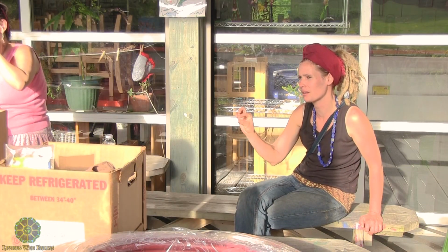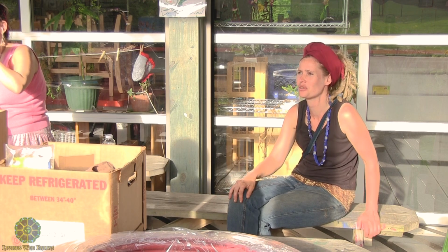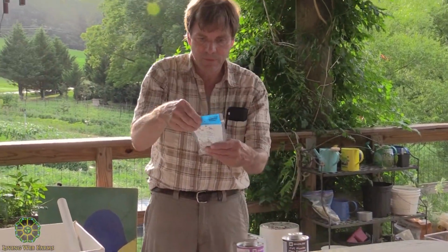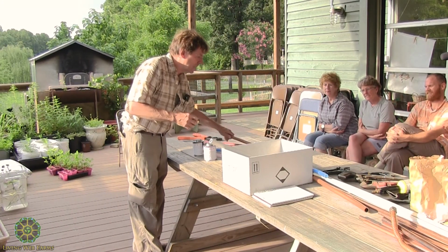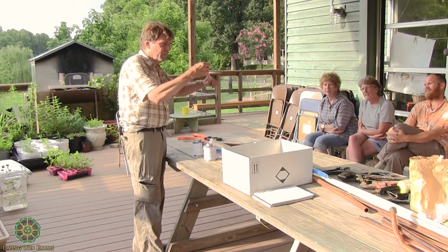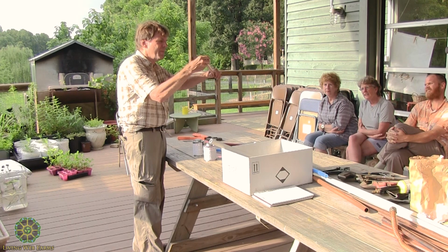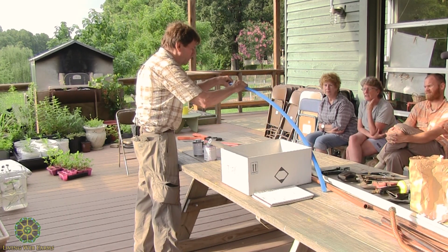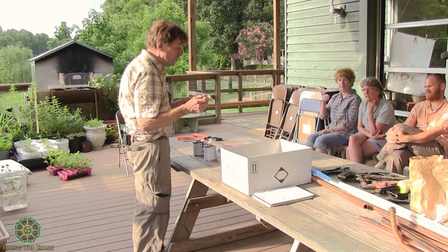So it's bad to use the plastic fittings? I never used them. I just use the metal because I think it lasts longer. The other thing to do, which is expensive, is what they call SharkBite. It will fit copper, because it's still all the same outside diameter. It'll fit the copper. It'll fit the PEX too, and it will fit certain CPVC sizes too.